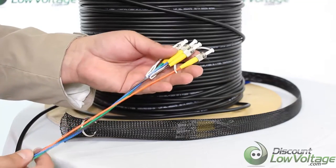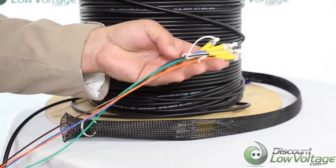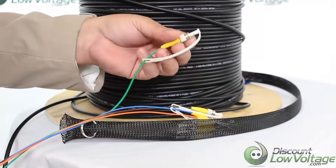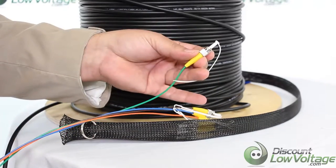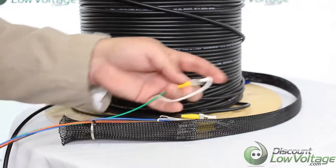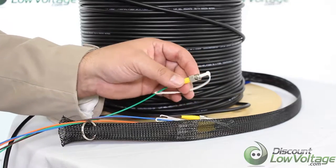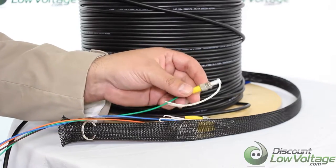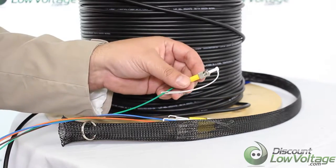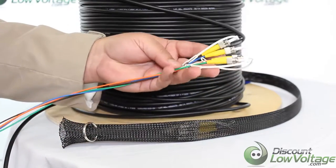The connectors themselves — we don't stagger them, they're all even. And as you can tell they're colored differently, so on the other side you can identify which strand is which. We also have caps attached to the tubing so you can unplug and, once you're done using it, replug them. You don't want to lose these — the fiber connectors are pretty sensitive to dirt. A little speck of dirt could cause you a big issue out in the field.